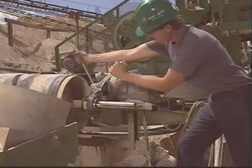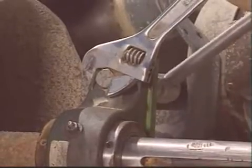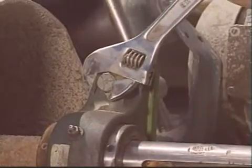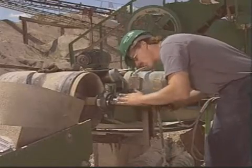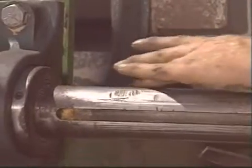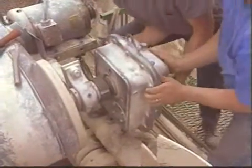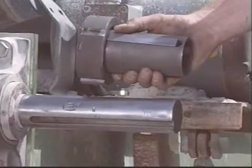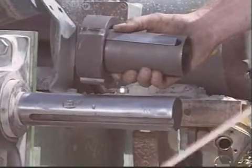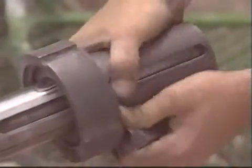Reinstallation of a Falk TA taper shaft mount Quadrive after repairs to driven equipment or for system upgrades is just as quick and easy. Designed to hold installation or reinstallation time and labor to a minimum, the TA taper can be used on short-driven shaft extensions and requires only bushing length engagement. To install, simply mount the TA taper bushing and key to the driven shaft.